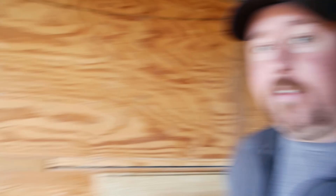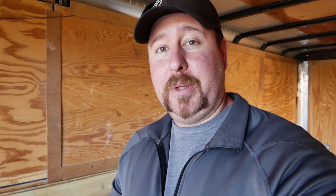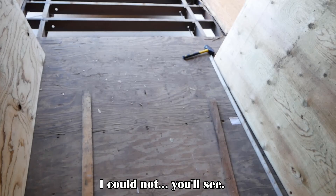I have the first board out. The problem was all those self-tapping screws were stripping out in the metal wherever they were attached, so they weren't coming out easily. Instead of trying to save all of that trim — it's just some eighth-inch little flimsy trim, look at how thin this stuff is — I'm not going to worry about replacing it. I'm going to get some one by three boards to make it a little thicker, and when I cut the plywood I'll leave about a quarter to half inch of space on either side. There'll be enough to catch the lip on the metal, and the one by three should cover that gap on the end.